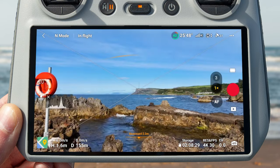If you are looking for the highest quality footage from the Air 3, make sure to avoid using the digital zoom modes. The Air 3 comes with a one times wide angle camera and a three times tele camera. You can digitally zoom on the wide angle camera up to three times, and up to nine times on the tele camera. But digital zoom crops in on the camera sensor, and the further you zoom in digitally, the lower quality video you'll get — by nine times zoom on the tele camera, there is a significant loss in quality.